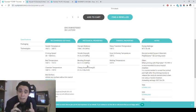Oh, and speaking about it, on the support side, how do you print supports with these materials? You have two options. You can either do it with breakaway supports, or in Method's case, you do have the option of soluble supports for polycarbonate materials. Specifically, what we use are SR30 supports. Those are soluble supports. They come directly from our partner company, Stratasys. Super efficient and kind of like a no-brainer.